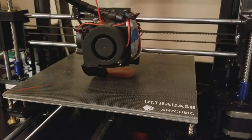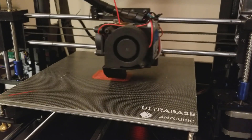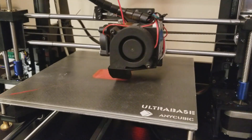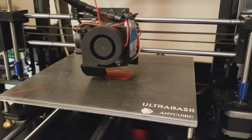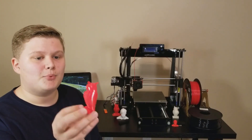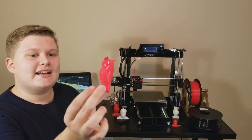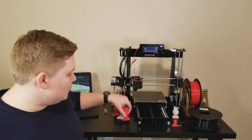The printer will get slightly off level and you have to deal with failed prints — even if it's a little off level. But luckily, this does have a heated base, something that the MakerBot printers do not have and something that's becoming more common among 3D printers, especially in the lower price range. With ABS, you also have the advantage of being able to use acetone to smooth the prints. You can give it that injection mold kind of look with acetone — something that you can't do on PLA.